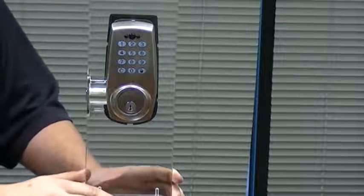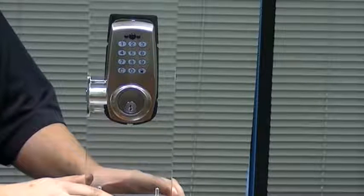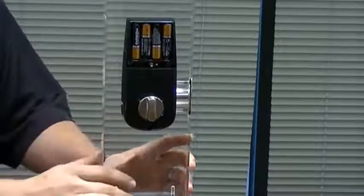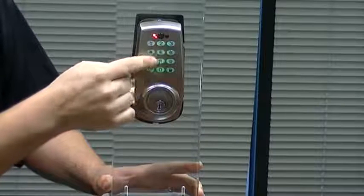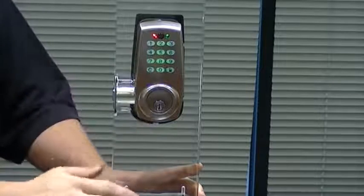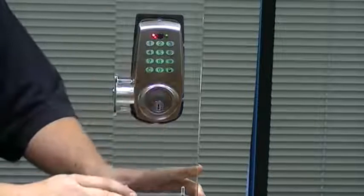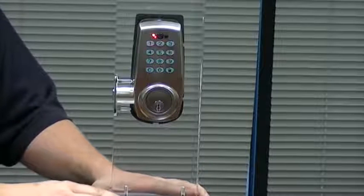Next, vacation mode. Vacation mode allows you to disable all user codes while you're away. First, press and hold the set button for 2 seconds until it beeps, and then let it go. Then, enter your programming code, followed by the lock button. Now, enter 50LOCK. Then, press 0LOCK. Wait until the unit times out to test to make sure that the steps were followed correctly.